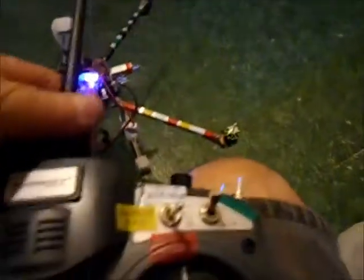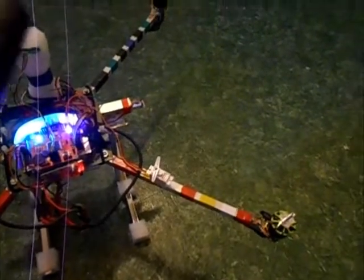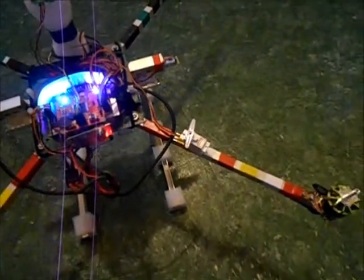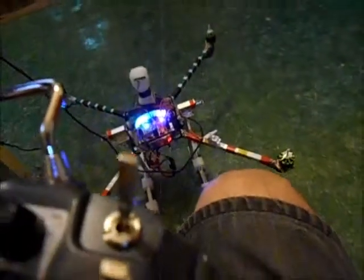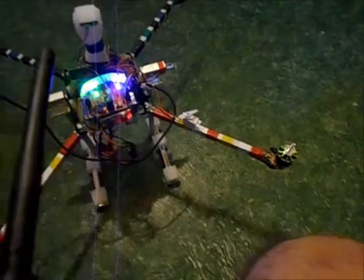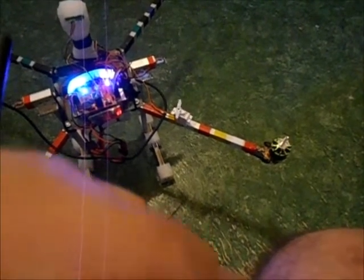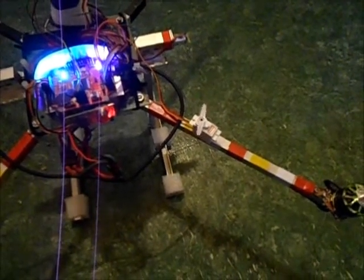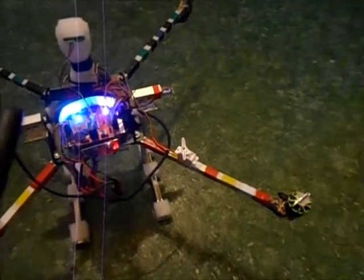What I got going on here now is I hooked up the little servo that I bought. I plan on using it as like a searchlight. I'm going to mount my three LED array — it's three little real bright LEDs connected to each other with a common output wire and input wire. I want to mount it on that servo. What I'm doing here is moving the hover throttle pot, and basically I can control which way the light goes. I'm going to mount that in the head of the craft, the cover, the cap. So every time I turn this, that'll turn. It's just a little goody. It's not going on there until the craft is flying properly, so it'll be a while.